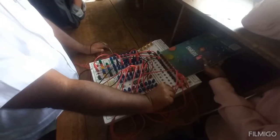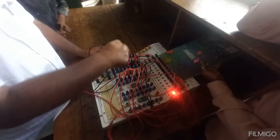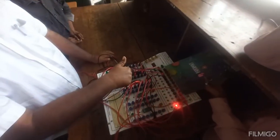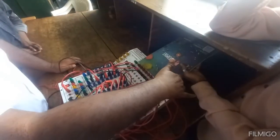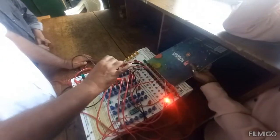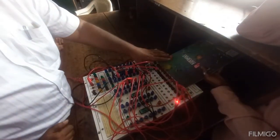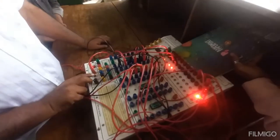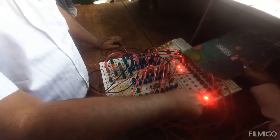I will make mode 1 here. I have applied parallel input to pins 2, 3, 4, 5. Now I am observing 3 outputs, and only exposing the final output to demonstrate parallel-in serial-out. I am applying 1, 0, 1, 1. Now I apply the clock. If I make mode 0, then only shifting takes place.